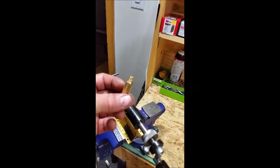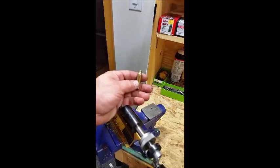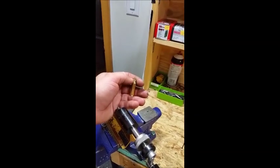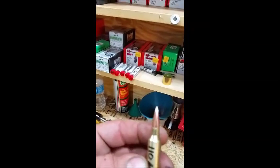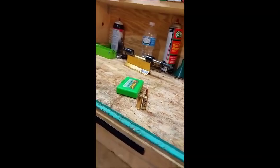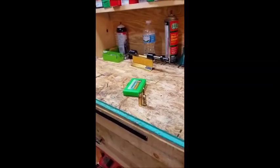This whole procedure will also work with my new round coming out — a 25 caliber based on the same case. We just start sticking more bushings inside the bushing die. I do it in four steps to neck it down to 25 caliber, and you end up with a 25 cal case like so, compared to the 270. There you go — I hope it shows people the procedure I go through to produce the 270 brass.